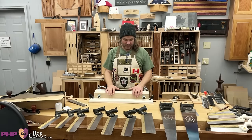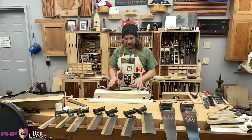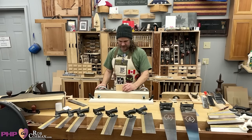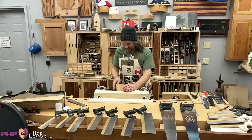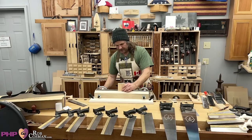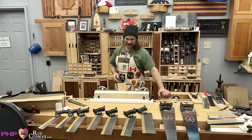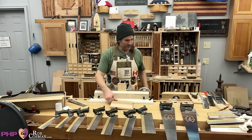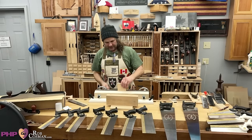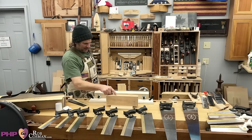By the way, one of the advantages of this Moxon vise is it allows you to get at least 3 or 4 inches higher, maybe even more, so when you're sawing you're not having to bend over. But like Jake said, if I'm marking on this piece, I'm using my sawtooth blade to come across here. I don't want to be getting into this, so I can't have it sitting down here. So what I told you earlier wouldn't work. We need to have it up about here, which means this piece has to be this high. But if you do that, and you've got your support piece back here, something like that, how are you going to know the height to get this to match it perfectly? So we've got to figure out some way to reference this over to here.